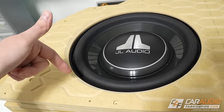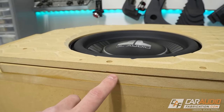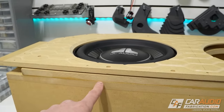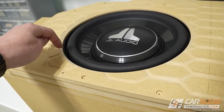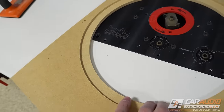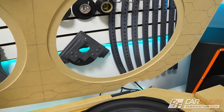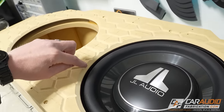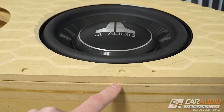There's something else I want to address — I did a quick test fit with the subwoofer and knew this was probably going to be an issue. I actually have the subwoofer touching the back side of this piece because of the material stack-ups. We do have a standoff added when we built the enclosure, but rather than adding more thickness I can remove some material from the back side of this piece using this large rabbiting bit. You can see it cuts a groove into the material, so once flipped over it provides clearance above the subwoofer. With that rabbiting bit pass complete, the test fit is perfect — flush with the surface and no more clearance issues.